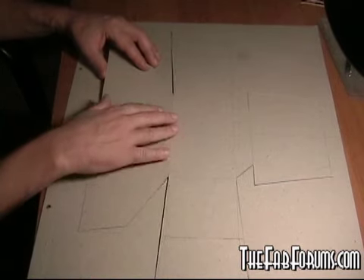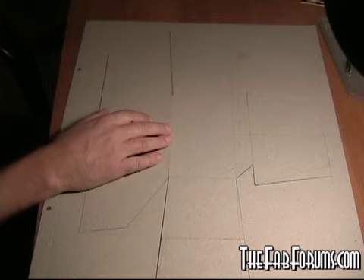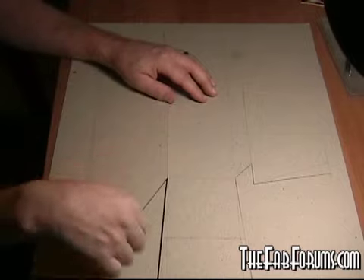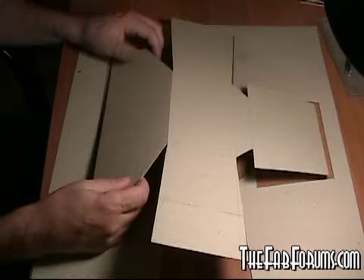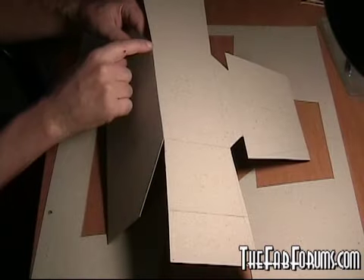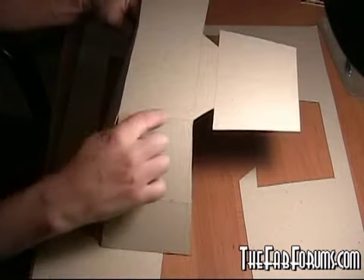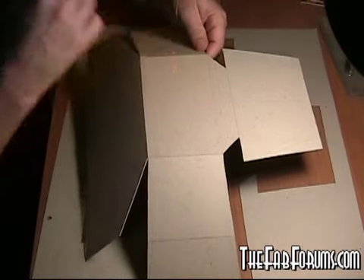You can actually use this flat. The reason I do it like this is because you can use this flattened image — you just lay it right on your piece of sheet metal, trace it out, cut it, and bend it on the same lines. Whereas if you didn't, you'd have to cut each piece out individually and weld it. This way it actually cuts down on the welding.